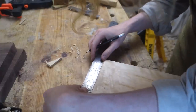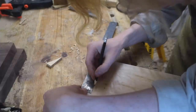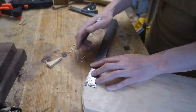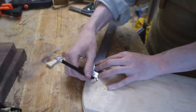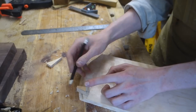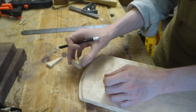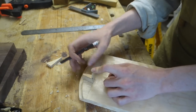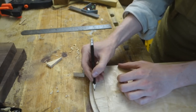In the layout stage, it's important to know if you're planning to make the lid by sawing through one of the pins and separating it from the box that way. That was my plan, so I made that pin slightly wider than the rest. I also varied the tail size a bit, so the longer ones in the middle are also a bit wider than the shorter tails on the edges, so it looks more balanced. The joinery will be a focal point of this design, so I wanted to think it through a bit more than I do for primarily structural joints.